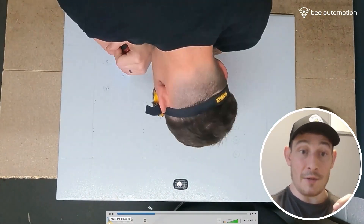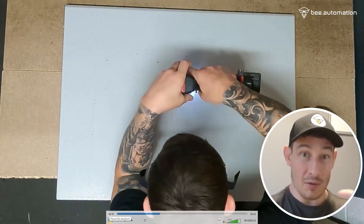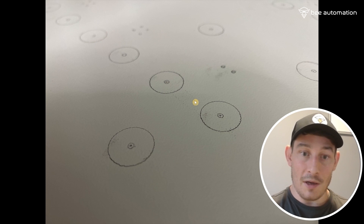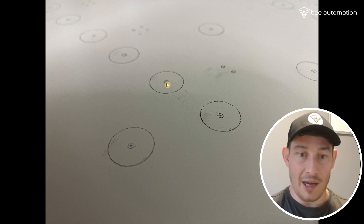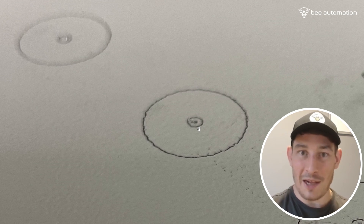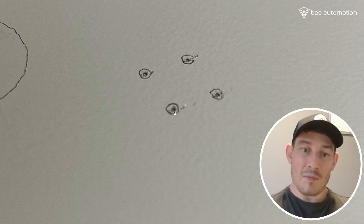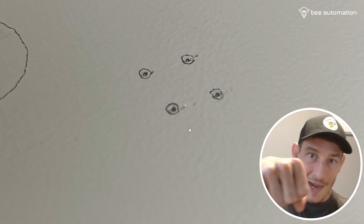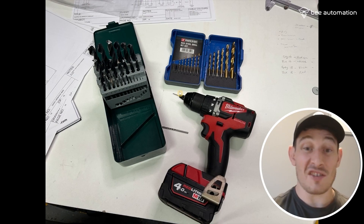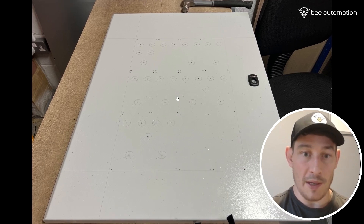Pilot drilling all of the corners of those plates and the centers of those 22mm holes for the cam switches and indicator lights. Here you can see what the center taps look like — pretty self-explanatory. On the smaller holes, it's pretty much bang on, but I would be angling the drill slightly just to make it more central while doing the pilot hole. Just using standard drill bits — nothing special.